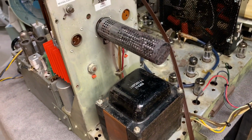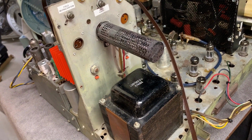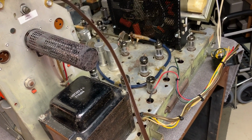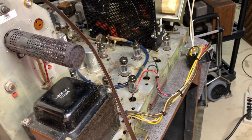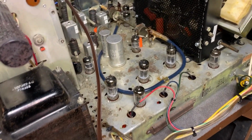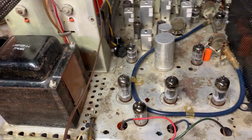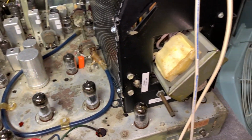And one of the questions I got was, well, I got this radio or TV from the late 40s, and all its resistors are still good. Yeah, you also got to realize, how was it stored? This was stored in a damp basement for 50 plus years, and those old carbon comps will just absorb all that moisture and make them go up in value. And even smaller ones, that's what I kept running into. 80% were bad in this. So that was why I redid it. Just redo the whole thing. I mean, at that percent, if it's just a handful, that's different, but they're all bad.